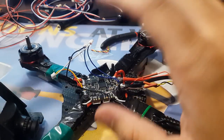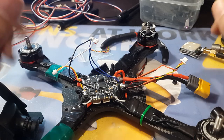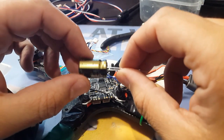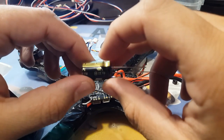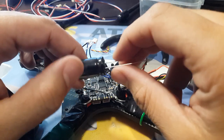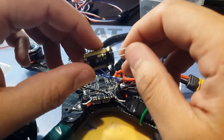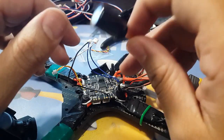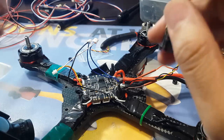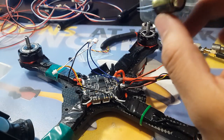I had to order a new one and I replaced the top and redid all the wiring. One thing I also ordered was low ESR capacitors. This is a 1000 microfarad 25 volt capacitor — it's a low ESR Panasonic, or at least that's what the listing said. I got it off eBay. I was trying to go for 35V but couldn't find one, so 25V is good enough since 4S is 16.5V. I think we're going to be totally fine.